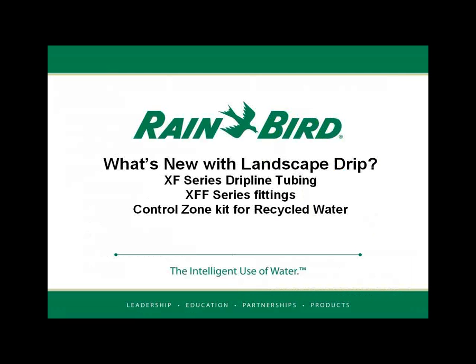I have one comment on the HE van. I've always, from way back when, really liked the RainBird adjustable arcs. I call them, not vans, but just in the ease of turning that and then watching the spray pattern increase as you turn it. I have noticed, though, in my own situations that they can get out of adjustment over time. Just the pressure of water going through them makes them slightly contract or expand a little, and while it's operating, you really should go around on the old ones and flip them back and forth and readjust them a little, get them back into shape.